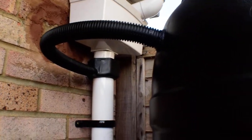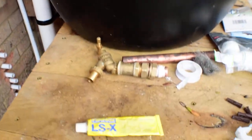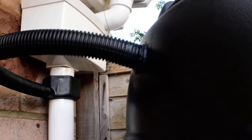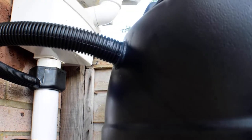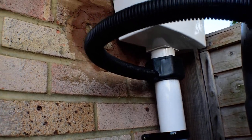Another important thing: if you ever buy water butts and you've got this stuff that just sort of clips together, it will always leak — believe me, it will always leak. So what I've done is taken it apart. This is really good stuff — it's about a fiver for a tube like this, which is way more than you need. It's a non-setting silicone effectively. What you would do, like I've done here, is the spigot fitting where the corrugated pipe is sort of slipped over — take it apart, get a little bit of that on your finger and just rub it around the spigot and then jam it back on. And then the connector that's going through there has a nut on the inside of the water butt which tightens up onto it. When you've drilled the hole, just do the outside of the thread where you've got the little bit where the washer goes, put the washer in, tighten it on — and that just makes it waterproof. I've done that at that end as well, just where the corrugated bit goes onto the spigot.